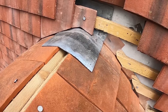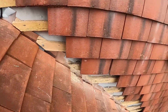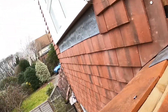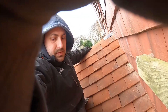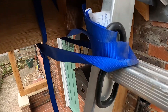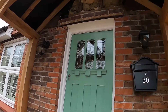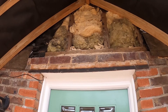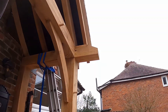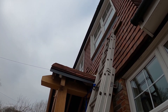We're going to pack mortar pug on the ridge and mostly the front. Also doing some tidying up on the bottom and sides. Don't forget your security — always tie your ladder on, because without securing your ladder on the side you could fall. We're going to take that tile away, re-felt, re-batten, and add the featheredge. That will be the last job. I'm hoping to finish the tiles and start the mortar work today — that's the plan, but we'll see how it goes.